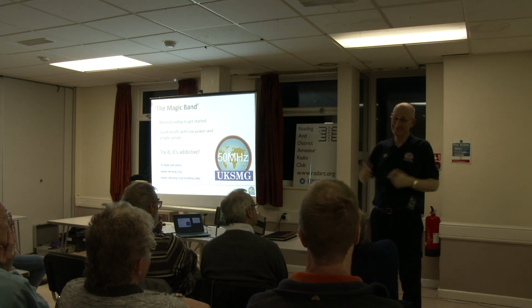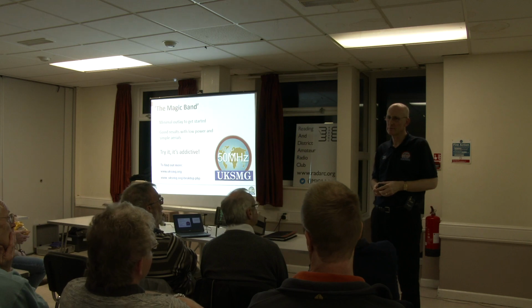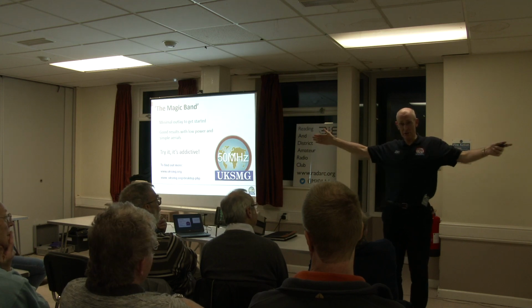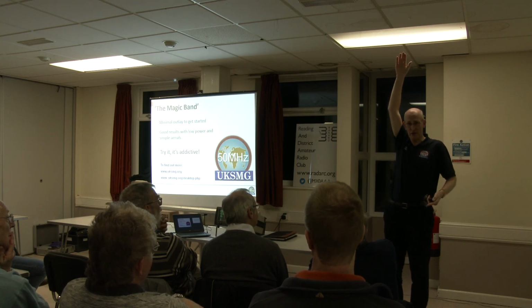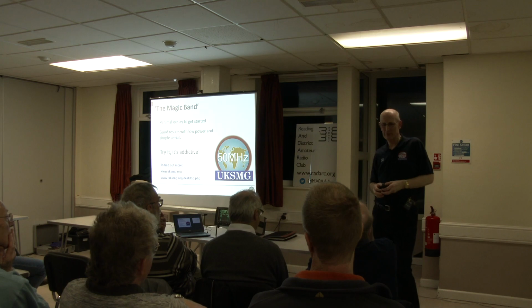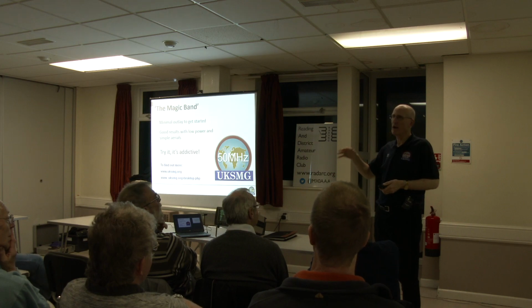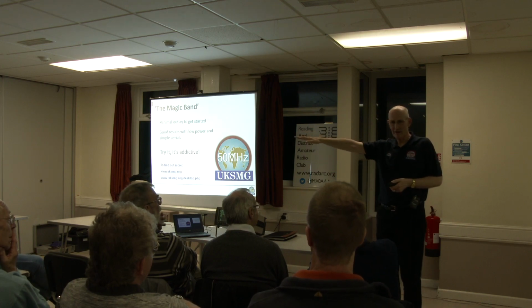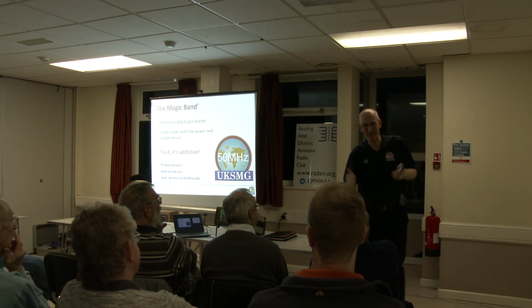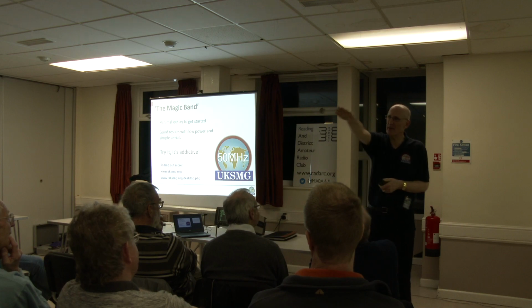So in my opinion. You rate that approach, the loops? Yeah, I find the loop fed array is much quieter, and obviously it's quieter off the sides. It's also quieter off the side upwards because you get galactic noise as well. Because your house and your next door neighbour are nearest. Absolutely. I live in a sort of semi-rural area, so some directions are really quite quiet. But if I point towards the village, no amount of clean antenna is going to get rid of that. Unfortunately, if the station I want to work is that way, it's sort of 10 dB noisier that way.